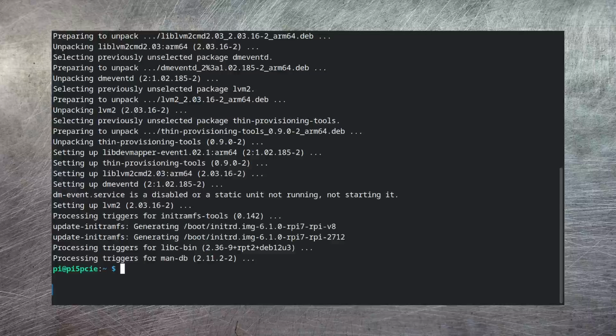To get around this, what I like to do is create logical volumes on each of the disks. I can then ensure that they are exactly the same size as each other, even if the physical disks are slightly different. So when I was talking about the disks earlier, and I was saying that you don't necessarily need to buy disks that are identical, for the purpose of building a RAID array, they do need to be the same size. So as long as your disks are roughly the same size, that's fine. You've just got to size all of them based upon the smallest one.